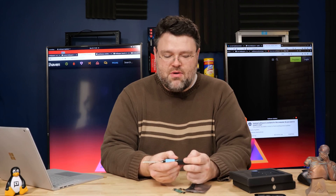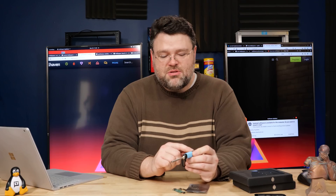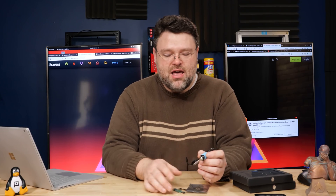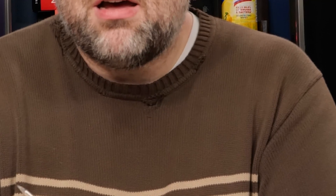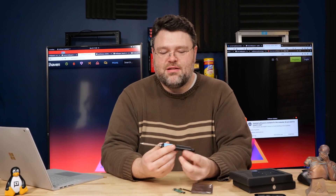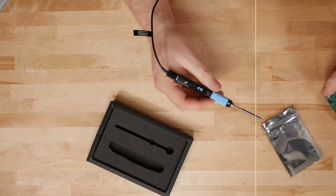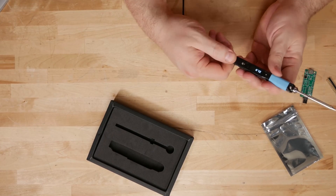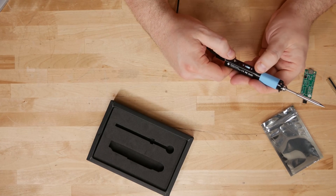I've hit the button to wake it up and it's going to zoom up to 350-360 degrees Celsius to use that really awesome RoHS solder. Oh look — you can see the smoke, it's getting hot, it's melting the solder remnants that were on here because I didn't clean the tip really well. It has an automatic shutoff that you can set. You can also set it for left or right-handed operation — if left-handed, it'll flip the screen, and you can flip the plus and minus buttons to navigate.